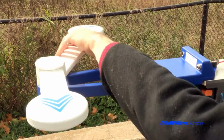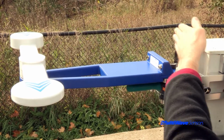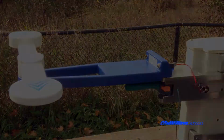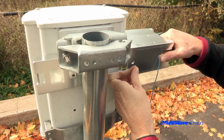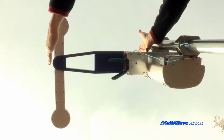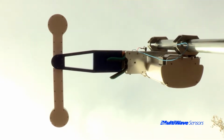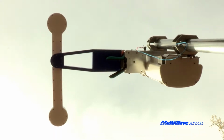Generally speaking, it is recommended to always use the T position because this provides maximum extension of the GPS antenna's elements from the antenna being aligned. For the same reason as keeping the bracket as high up the antenna as possible, proper GPS antenna extension is instrumental to mitigating multipath error effects on the azimuth solution. Therefore, space permitting, for live antennas, it is recommended to have the tool to the right or left of the antenna and the arms in the T position.